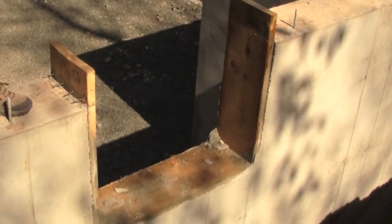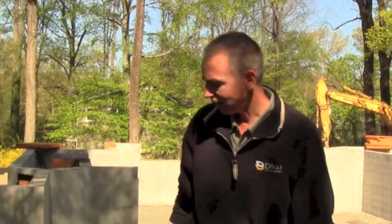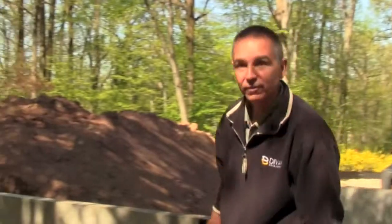We're getting ready for our steel. It's going to be delivered soon. And once they finish all of our spraying, then I'm going to go for our backfill inspection. I'll have our inspector come out here, check it out, make sure we're all good. And also today they're coming out to do our foundation location like I talked about.